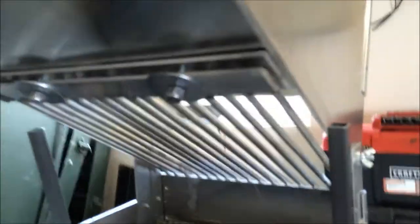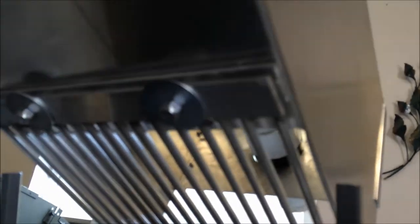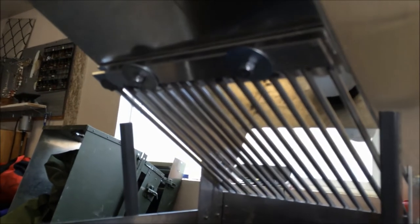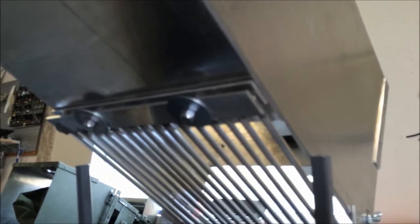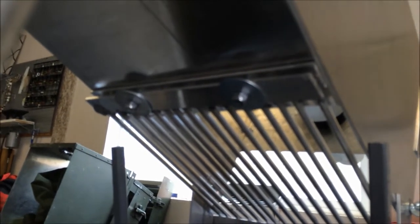I set it up in between two one inch flat aluminum pieces. I just used JB weld on it. I set the pattern up — I cut them to 12 inches in length, set them on the bottom one inch plate, half inch centers apart from each other, and I just used JB weld. I put the top plate on, clamped it together, drilled holes through it so they all match up, and I hooked it on with two quarter inch nuts and bolts and some washers.